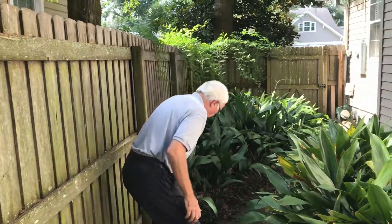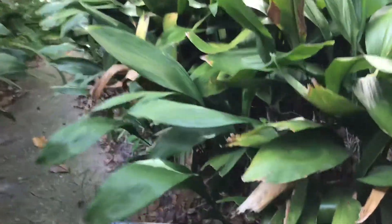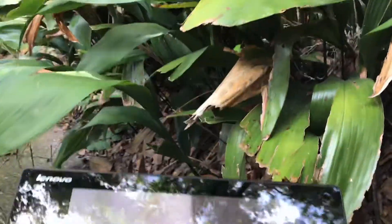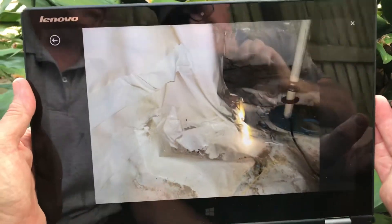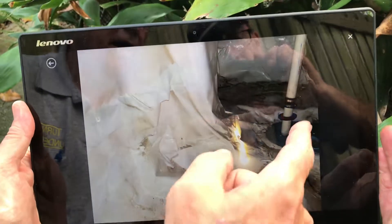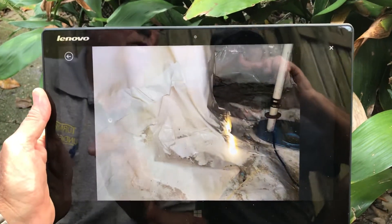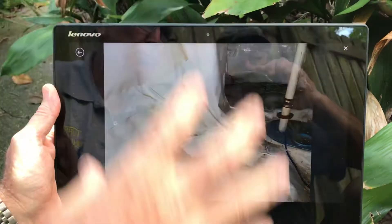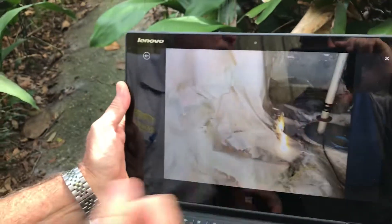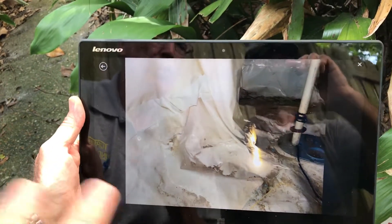What is it that's done in crawlspaces that can be a real problem? Well, if you look here, this is a picture of a local encapsulated crawlspace. Now the word encapsulation implies to many people 'sealed,' but as you can see the tape here is not even sealed. There's been water coming in above the liner, and even the sump pump above that is not taking that water out. In this same crawlspace two months ago, we pulled 60 gallons of raw sewage that had spilled down into the crawlspace and it could not make it to the ground where it could decompose. There are other problems with crawlspaces as well, and we'll get into that on the next video.